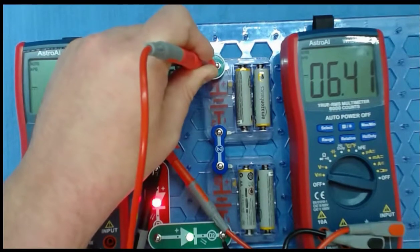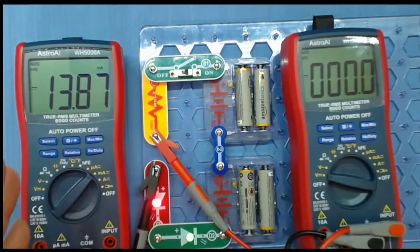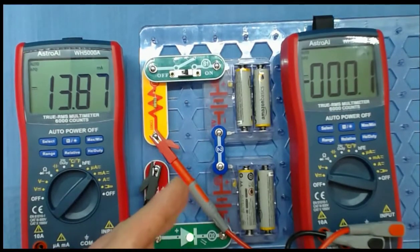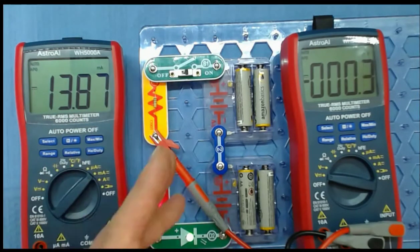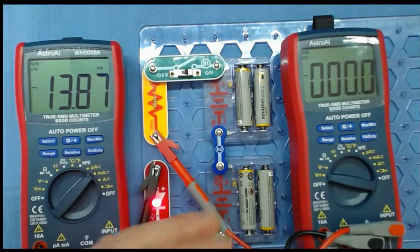You're going to get that total back, because Kirchhoff's voltage law states all the voltage going in has to be dropped. It has to be expelled. It can't be 0 volts coming back to the battery. So all that energy has to dissipate. Now the current in a series circuit is going to be the same.